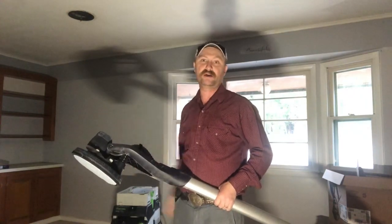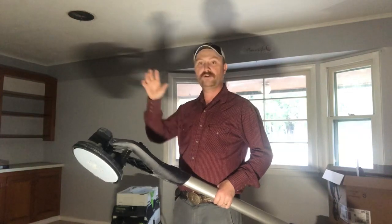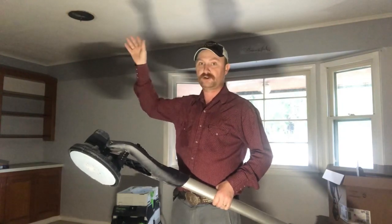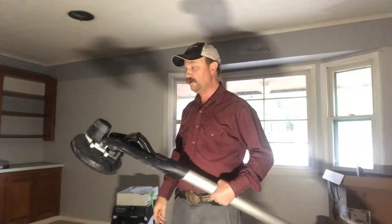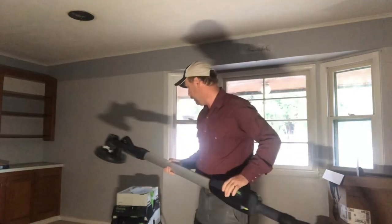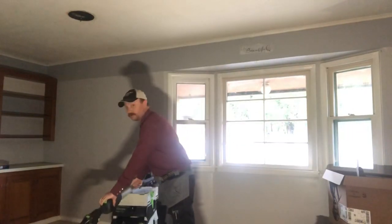I'm running it on the Festool AutoClean CT36. So far it hasn't clogged a bag — haven't even really checked it because there's almost nothing coming off the sander head. The only things you see are the big pieces of popcorn that fly out the side when you first set it down, so watch your eyes. Floors are clean — I don't see anything on the floors in here. Customers are impressed on both houses; they've gone quick, come out better than expected.